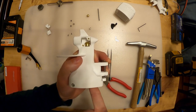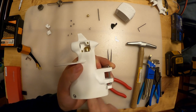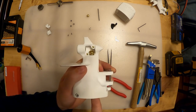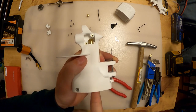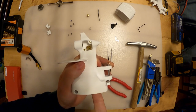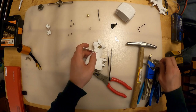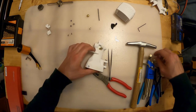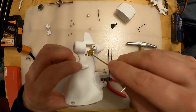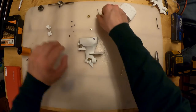There's the first shaft and there shouldn't be any binding. This should be relatively smooth - it will wear in a little bit as we run it, so it's okay if it's slightly stiff, but it should be finger-loose. You should be able to rotate it with your fingers, otherwise stop and go back - you might have a problem. I also recommend Loctite on these little set screws.